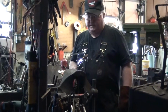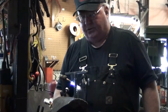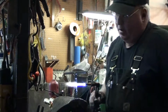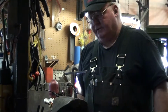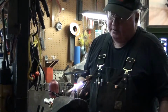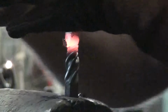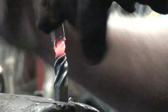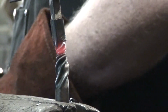So far, that little twisting tool seems to be okay. Probably if it had cheater bars, had a little bit longer handle, it'd be even better. I'm going to leave about 1/2 inch of the tube at the top not heated, and then I'm going to try to really speed up the twist in this area, because eventually it'll just kind of twist it right off. So normally you'd be thinking, watch out, you'll twist that off. Well, precisely what I want to do.